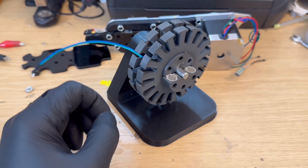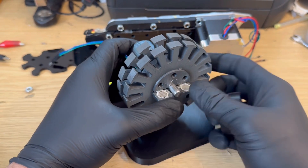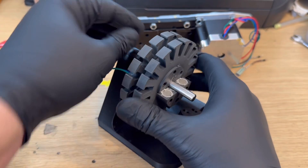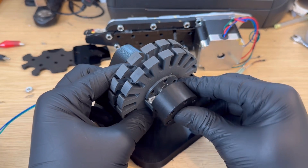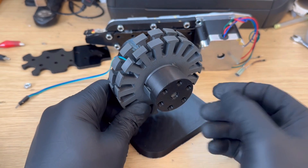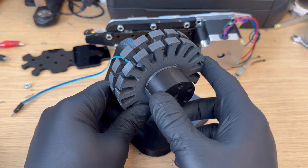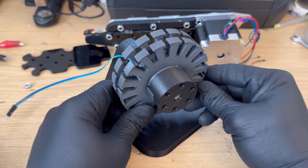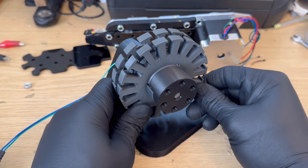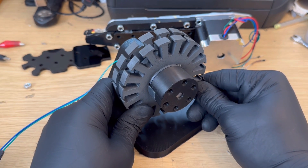The idea is that you have this part in basically two pieces, with a center shaft running through it, and then this piece here slots over the top. There's the slightest bit of movement left and right on this, meaning that when you move in the exoskeleton and just start to apply pressure, you'll apply pressure onto that force resistance sensor, change the value, and start activating the motor. This is basically how electric power steering works on a steering column. These will require a little bit of tuning to make sure the proportional value equals proportional power, so that it all works smoothly and isn't jittery.